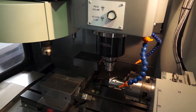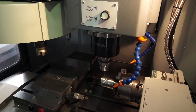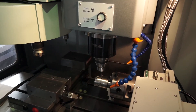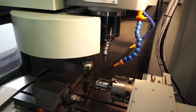The spindle motor on this machine is 8000 RPM and it's a 5.5 kilowatt motor with a BT40 tooling back end. So BT40 — although it's a small machine it's still got rigidity there with a BT40 spindle and still got torque with over 5 kilowatts of power.